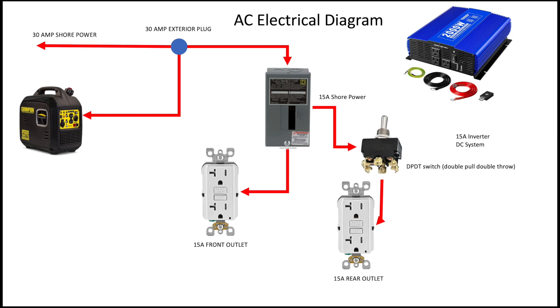This works fine during the daytime when I'm running off electricity. But at nighttime, if I'm boondocking and I have the generator as my main power, you don't want to run the generator all through the night because a lot of places have quiet hours. So what I've done is I have an output from the AC inverter that generates voltage from the batteries, going into a double-pole double-throw switch. This allows me to, at nighttime, switch from AC voltage coming from shore power to the DC power inverter.